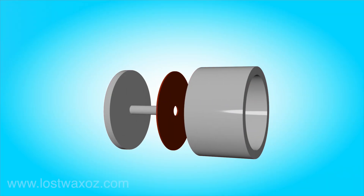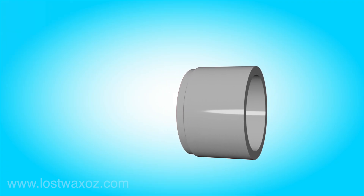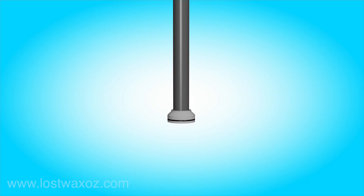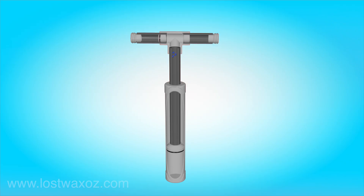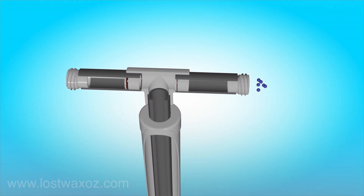The heart and soul of the pump are two very simple 3D printed valves I designed. There's a disc that pushes out when air goes one way, but if the air flow reverses direction, the disc shuts and seals the valve. The valves live in the handles of the pump, which are connected to a plunger. The plunger goes in a tube with some caps on the end, then add a couple of hose connections to the handle. When you lift the plunger, air is pulled through one of the valves, and when you push it down, it's pushed out the other one. Now we just gotta make it.